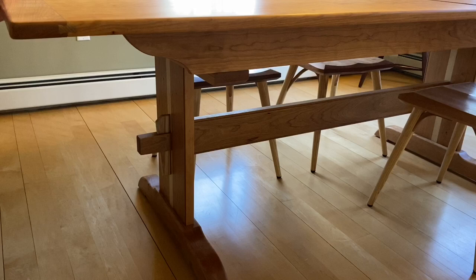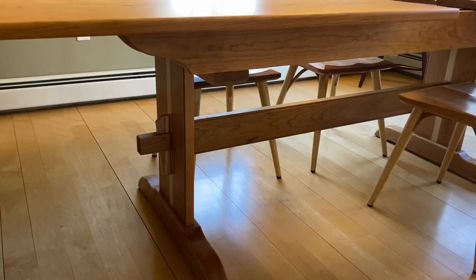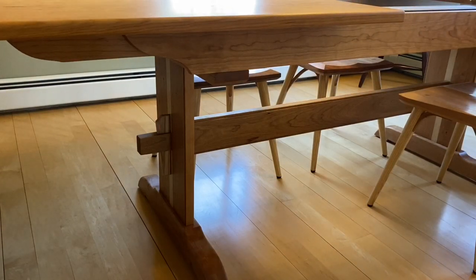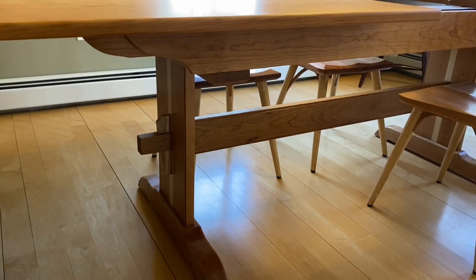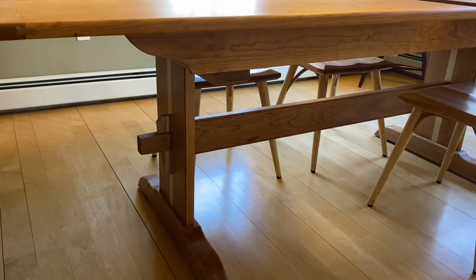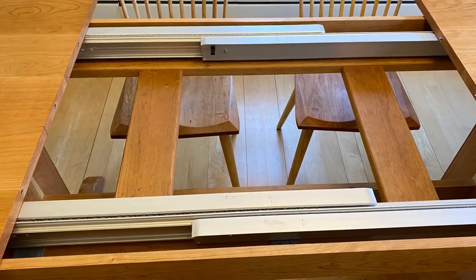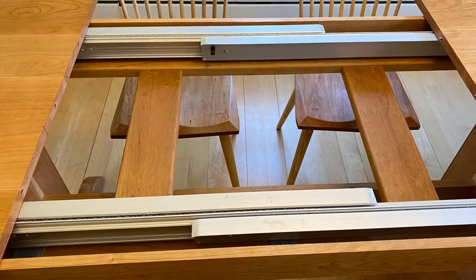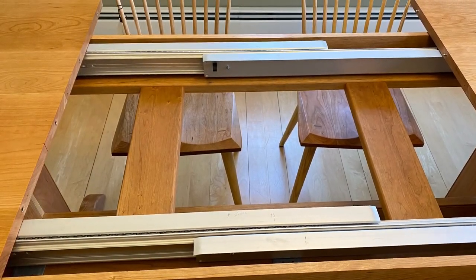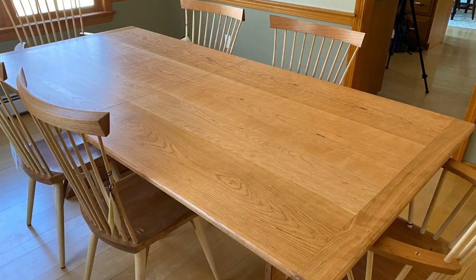Here's a side shot of how I put a stationary apron in the middle to help hide the table slide. I also added a smaller piece of apron screwed underneath the tabletop that moves along with the top to help hide the slides. I left a little section in the middle to store the two 18-inch leaves — they can lay right on top of those one-inch-thick supports in the middle, and then the tops close over.